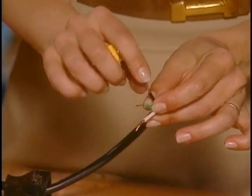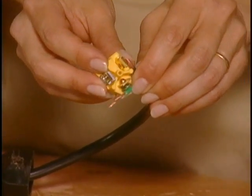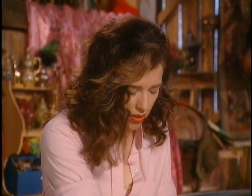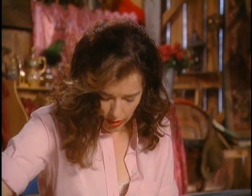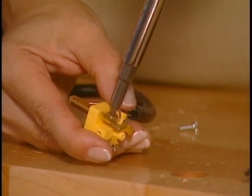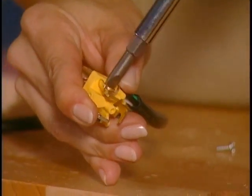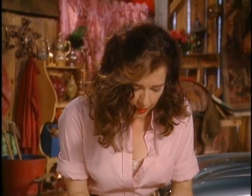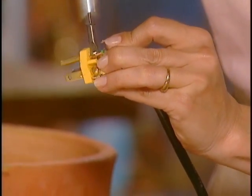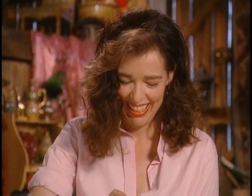So make a little hook shape with the wire, and then you want to just slide it into the space between the top of the screw head — that's going to clinch it. I'm left-handed, so let me just get this right. Aiming is everything. I attached it onto the screw in the same direction — see, as I tighten the screw, it actually pulls more of the wire in. Otherwise, you really fight it. So that's pretty tight. Now I'll just attach the green one in the same way, and then the neutral wire, the white one. And now the black one's come off, so I'll have to go do that one again, and then the white one.